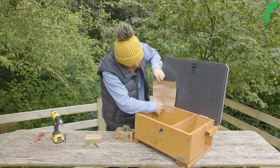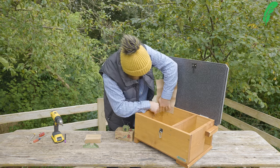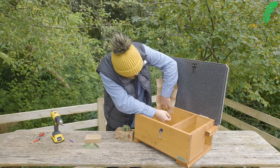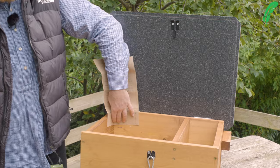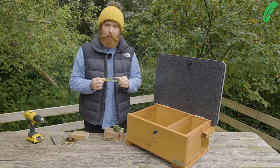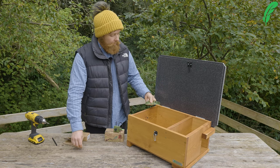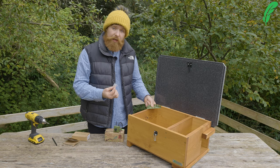As I put this into the corner, the black line aligns on either side in the right angle. I'm going to take my pen and make a mark on that line on either side so I've got my bracket marked up. That means I now know what height I'm going to be mounting my corner bracket. I'll mount it up on the mark I've made using the four little screws provided inside the bag.